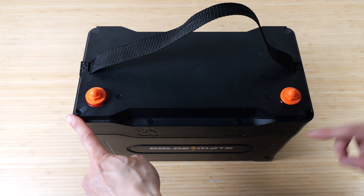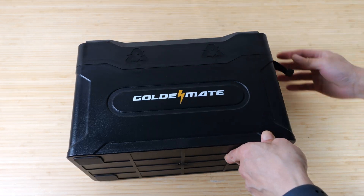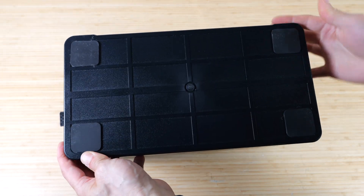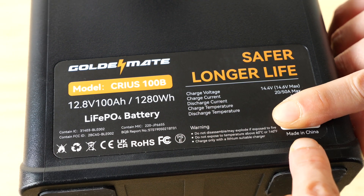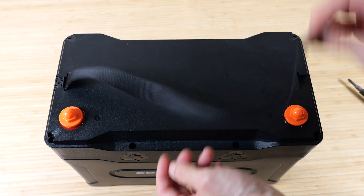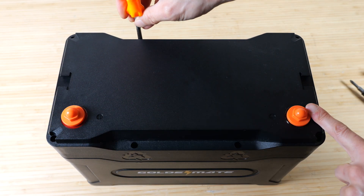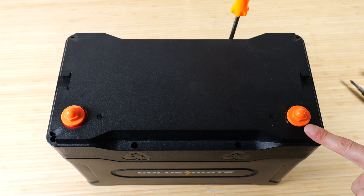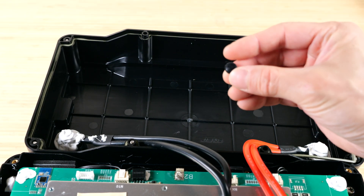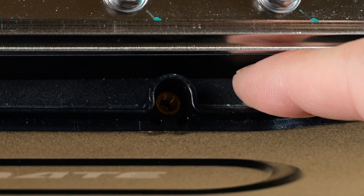At the top there are eight screw plugs. I'm pretty happy about that — I don't have to pry anything open. The bottom has actual rubber feet; many times it's just plastic. The label reads 100 amp discharge current, made in China. The plugs make it IP67 rated, but these rubber gaskets might wear out over time. Don't try to open this thing up yourself because it's very dangerous — if you accidentally get these cables connected, there's no safety to prevent maximum discharge of the entire battery and things will explode. The seal goes around the screw holes as entry points for water, but even if water goes through there, it doesn't really go inside the main chamber, so we're okay.